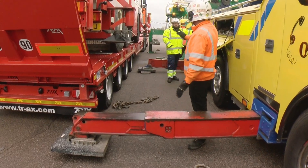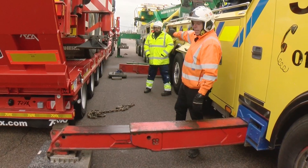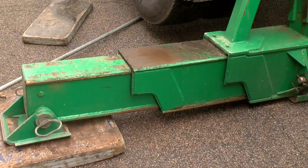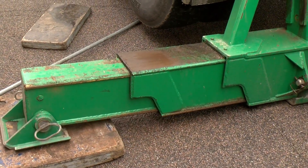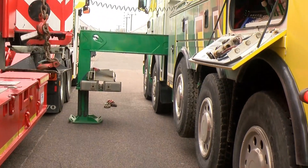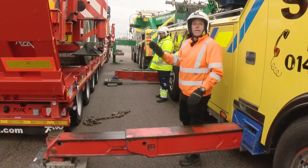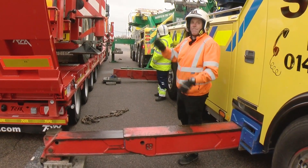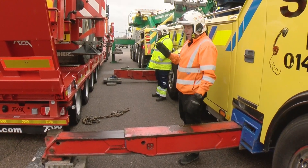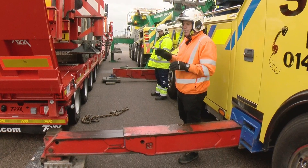On the back you'll see a four-stage leg on this machine versus the other machine in front that has a three-stage rear leg and an outrigger-type front leg — so this is a great shot where you can see the difference. The crane top is the same across the 1140, 1150, 1060, and 1075; they all have the same platform and the same options.